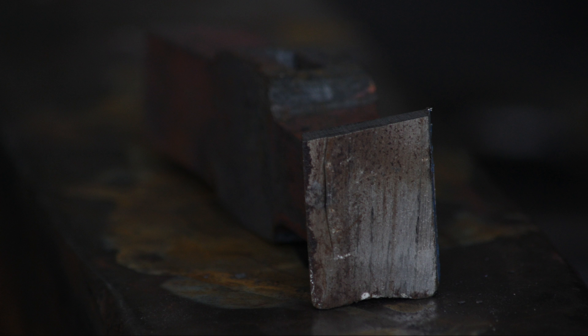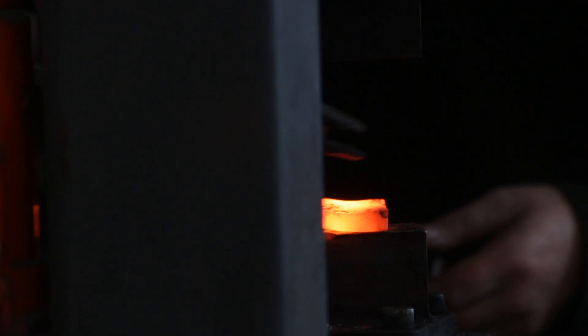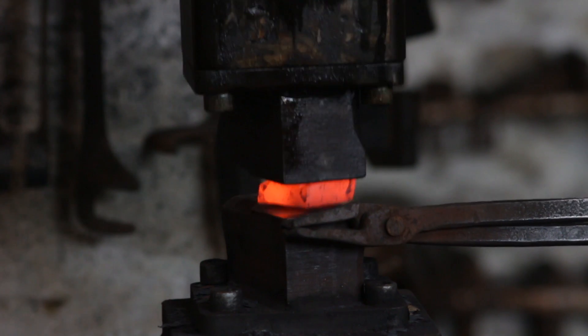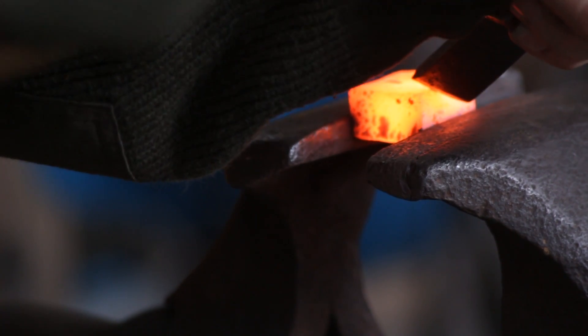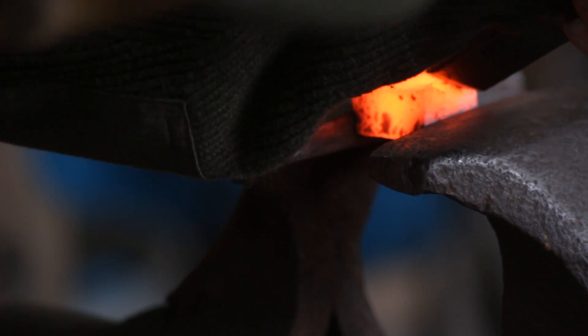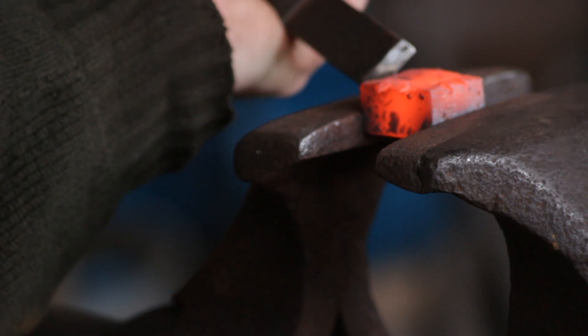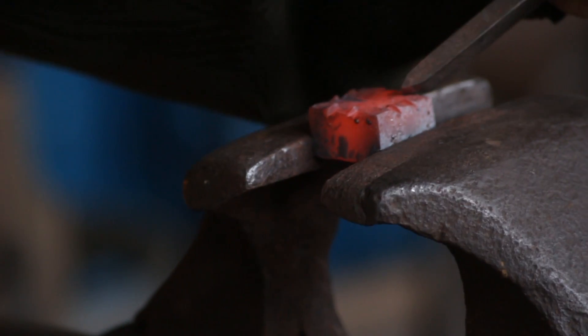Here is the high carbon steel face for the hammer end — it's not quite square so I will square that up under the power hammer. I deliberately didn't cut it square because I needed to thicken it up a little bit. Just under the hammer: square it, thicken it, and generally get it ready to weld. Eventually it turned out square and just a touch bigger than it needs to be, because I'm going to cut some teeth into it and also because I'll get a layer of decarburization on the outside during the welding process which I will want to grind off later. I'm cutting these teeth in — for those who've seen my Anglo-Saxon anvil and hammer videos, you'll know this is to grip it onto the body of the axe.